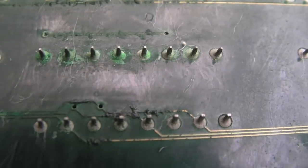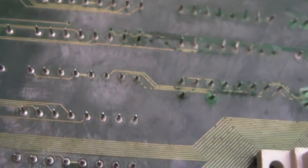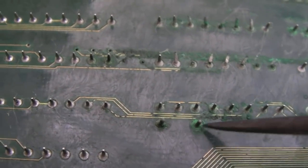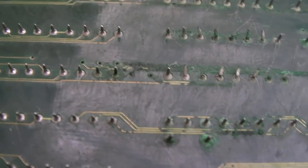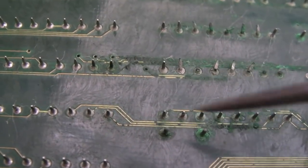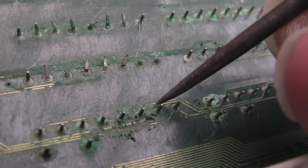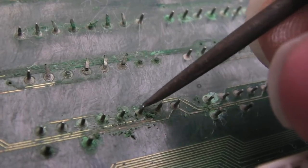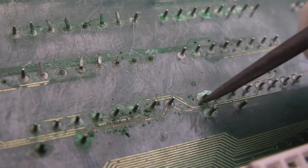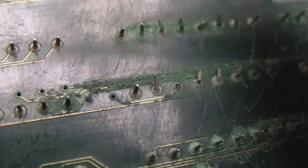It's horrendous, but luckily it's in a confined area. There are quite a few things to patch up. I'm going to go over this next with a tool and scratch all the surface corrosion off to get it as clean as possible, then get some flux on there, drag the solder braid around, tin any traces and work out where we've got breaks. I'm using macro so I can't actually see what I'm doing, but the green mulchy stuff on top that wasn't coming off with the brush does come off. The other thing I'll use is a fiberglass pen.